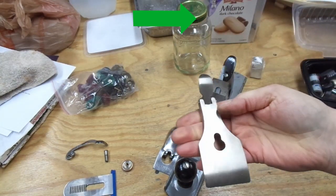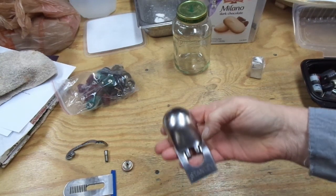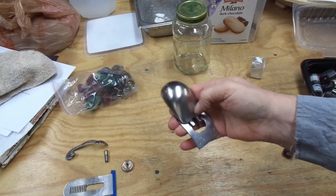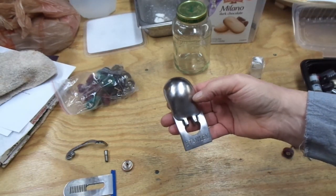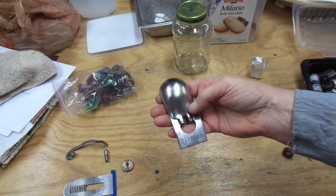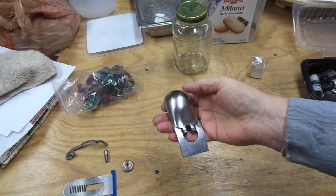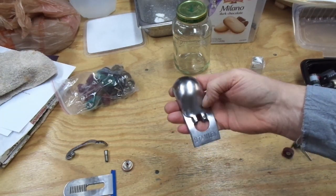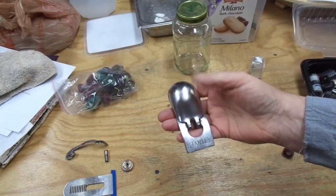When I refinished this Miller's Falls jack plane, I put a nickel plating on the lever cap using a nickel acetate bath. After doing a little more research, I'm going to use what's called a Watts bath — everybody seems to think it gives a better finish and it's not very difficult to do. You can't get copper to stick very well to steel because copper is more noble, but nickel does. It's actually a little easier to get the steel in good shape, put a nickel coating on top, then a copper plate on top of the nickel. The copper plate goes on relatively thick and it's soft, so it's easier to polish the copper to a really fine finish than to do the steel directly.